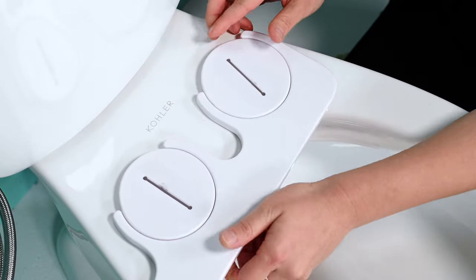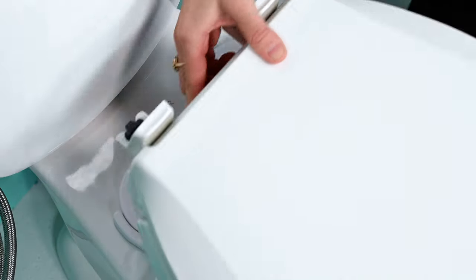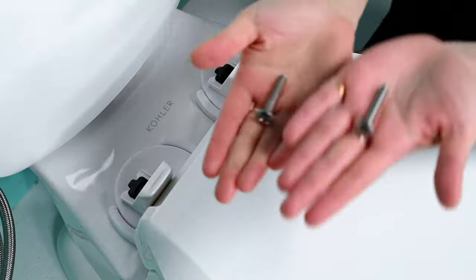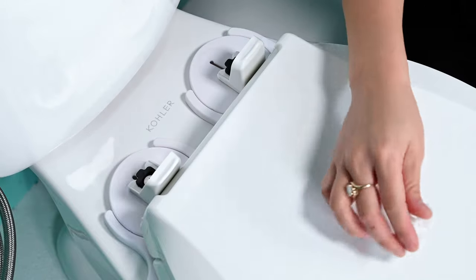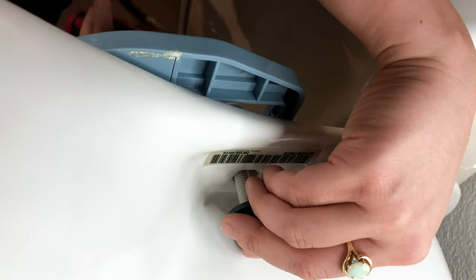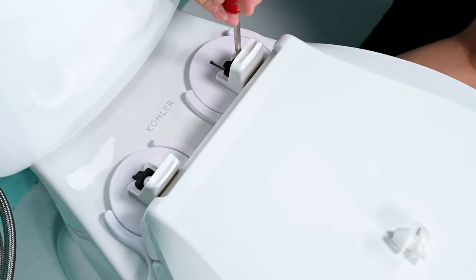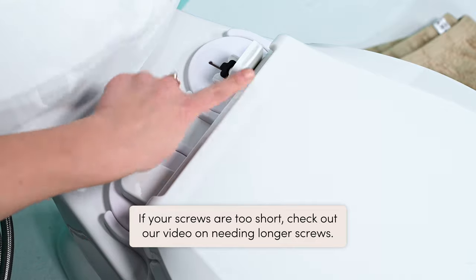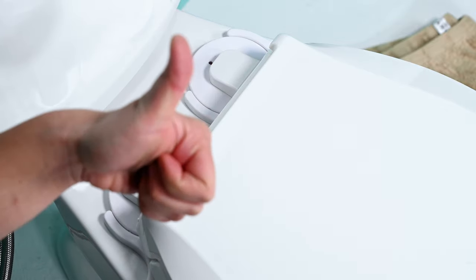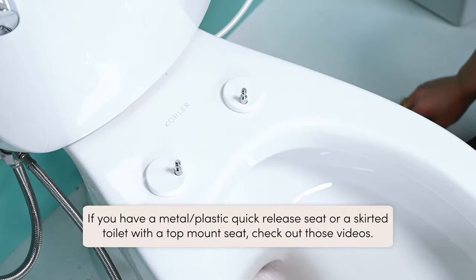It's time to put your TUSHY on the toilet. Set up your adjustable flanges and align with the holes on your toilet bowl. Set the toilet seat on top, then grab your screws and insert them into the holes with the best alignment over the bowl. Hold the nuts underneath while screwing from the top, making sure the TUSHY is centered and the toilet seat is tight. Tighten with the screwdriver. If your screws are too short, check out the video on longer screws — available on our spare parts page, Amazon, or a local hardware store. Always check that the nozzle is not pressed against the bowl and is lined up in the center of the toilet.